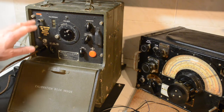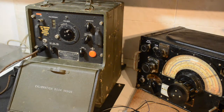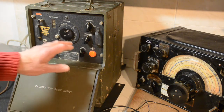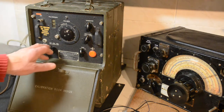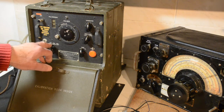The antenna is connected to that, loosely coupled to the antenna on your transmitter or receiver. The gain is actually the gain for the headphones — this has nothing to do with an RF output adjustment like the LM13. Likewise, the switch here, instead of just having a crystal on and off, we have crystal check, crystal only, and the heterodyne oscillator on its own as well.